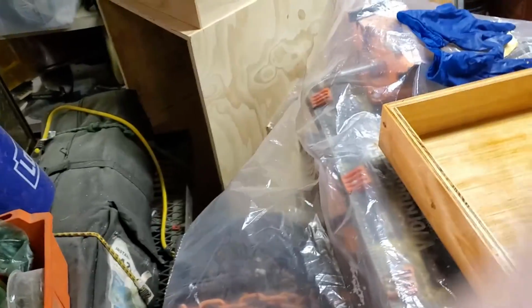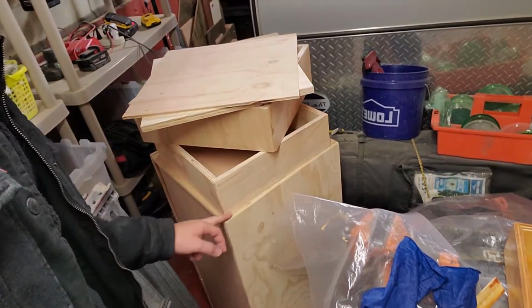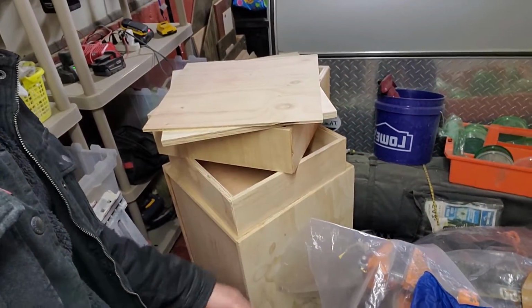The next step, so I've got the legs actually upstairs, and we've already got the tabletop finished, and this is the face of all the drawers. I've got the legs upstairs. They're actually set to be 1/2 inch shorter than the cabinet. Put the stretcher on the same piece of wood. So then it's actually 2 platforms that are attaching the tabletop instead of sort of a line and a platform.